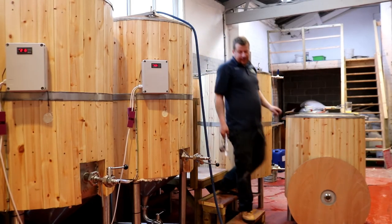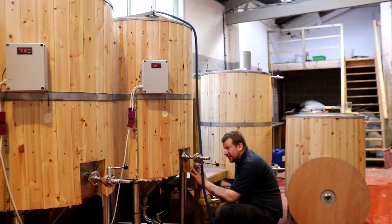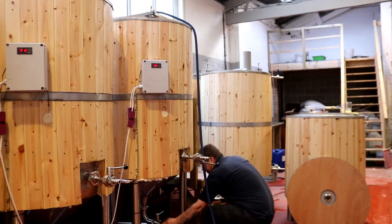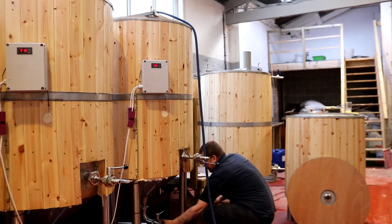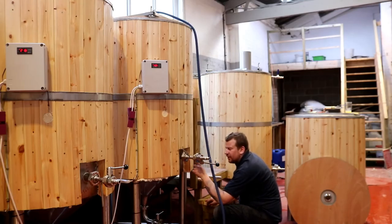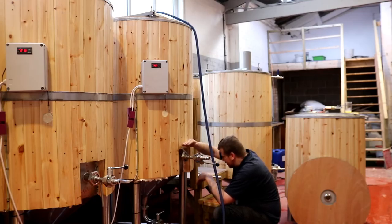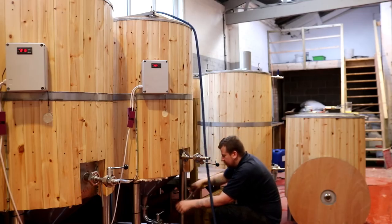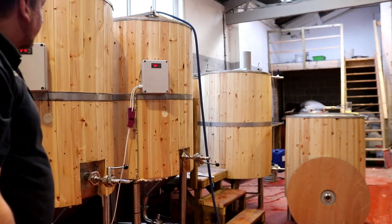Yeah. Let's get a RJT ring. So something we've noticed is there's no ventilation for these tanks. So what we're going to have to do tomorrow and Monday, before we brew anyway, is put a vent into the lid of the fermenters, so when we are recirculating, we're not going to explode the tanks like I was talking about earlier. And I can't vent here if my tank's that full with cleaning fluid, which will be a problem. We're recirculating, just like that.